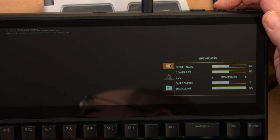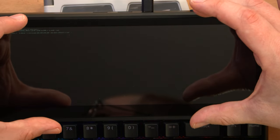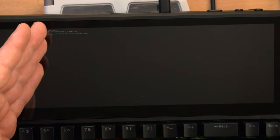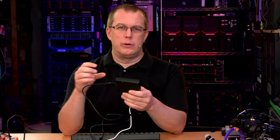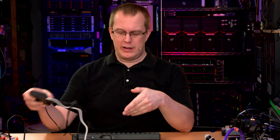Now it has in fact booted to a login prompt, but the text is tiny and malformed because the Raspberry Pi thinks it's connected to a 1920 by 1080 monitor, and this is actually 1920 by 515. So it's trying to output 1080 video, which this is processing correctly, but then it's downscaling it to basically 515p and squashing it. The monitor menu settings are pretty typical — brightness, contrast, sharpness, backlight, language, OSD timer, transparency, low blue light, reset, and color temperature. There's no way to change the resolution or display scaling in the device itself. So this is a major downside. I would have to go and get a proper monitor and keyboard out — why have this then?